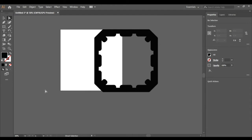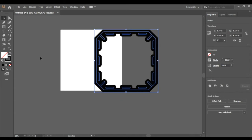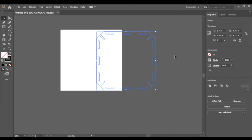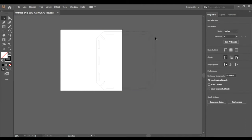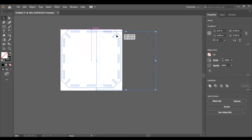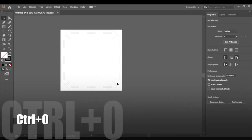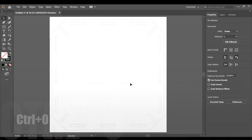From there, I can move back to the Black Selection tool, and with this, you can see when I click on a line, it selects everything at once. If you look over here to the right-hand side, you should see an Appearance box towards the middle of that sidebar. Our laser only understands lines, or stroke, that are .001 pixels as a cut line. You can see once I do this, it changes my design to be a very thin black line. Let's move our design over onto our artboard using Illustrator's assistive dots to make sure that it's centered. And now that's ready to be cut on our laser! Control-0 to blow our artboard back up to the full viewing window, and you can see that it's barely there in these little thin black lines.